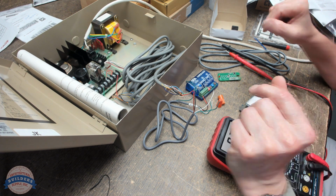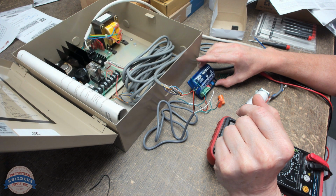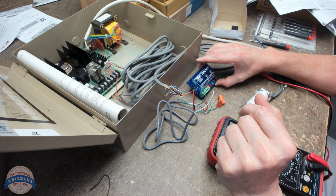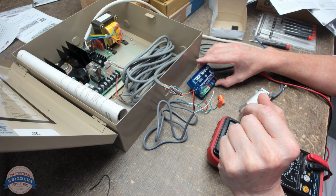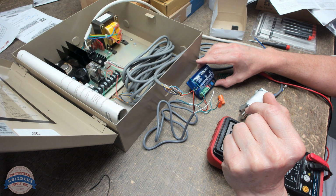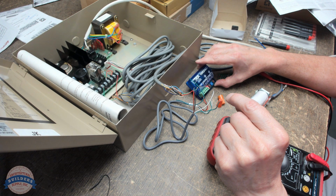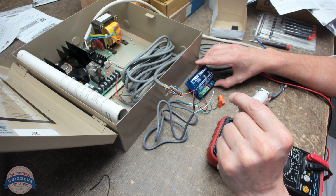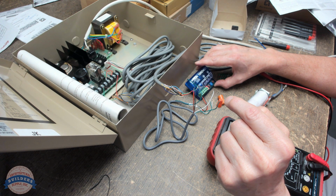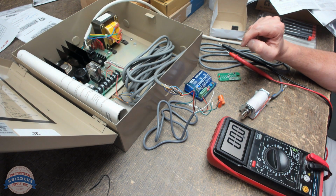Well, that's because the receiver is just a dry contact. So all it is, is like a switch to open or close a circuit. It doesn't provide any output voltage. So you could test it to make sure that it's working by putting it into activation and just checking for continuity whenever you're giving an activation. But if you're needing to supply power to something as well, you're going to have to run the power separate and then that just chooses a trigger.